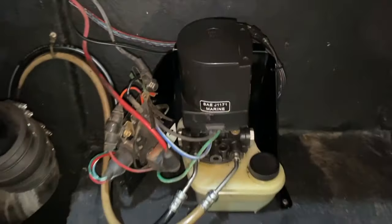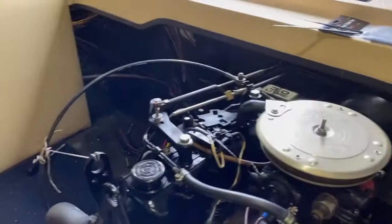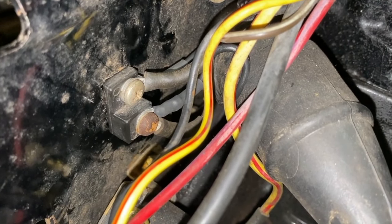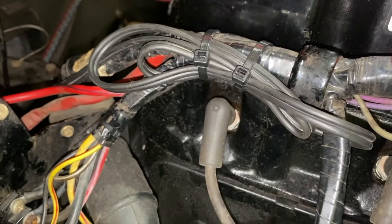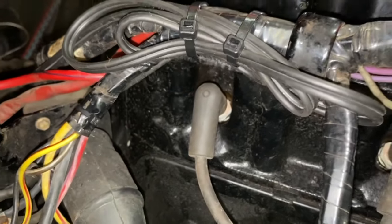Back inside the boat to the port side trim limit wiring — I've used zip ties to re-secure everything, cleaned it up a bit, and tied it to the back frame of the hydraulic pump in a more organized manner. Leave a little bit of play in your zip ties so you can move your wiring pretty easily. On the starboard side, I re-secured the electrical wiring and connection points, ensuring the trim sender wire connection points were the first to go on, flush with that block as the old ones were. Spend a couple minutes using zip ties to organize the wiring so it is not loose, dangling, or touching the hot engine.